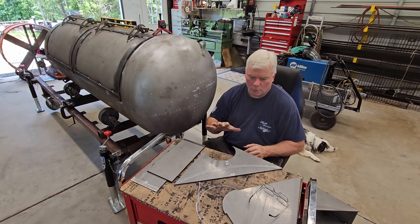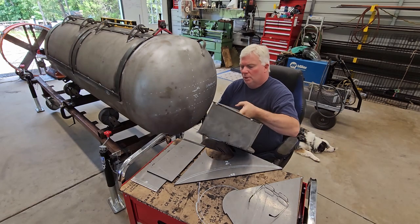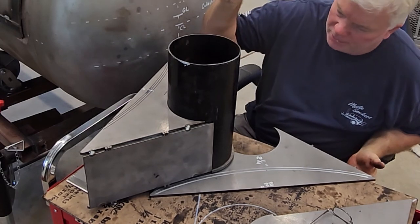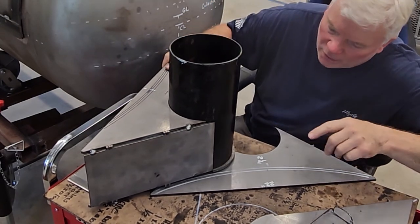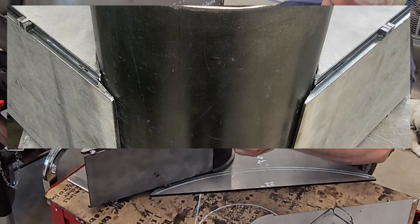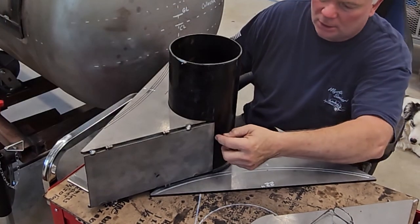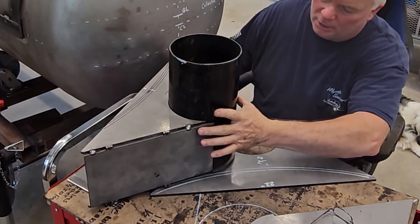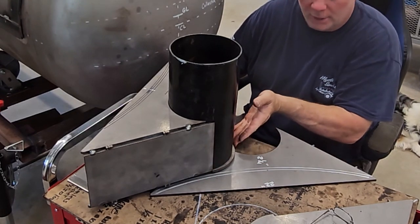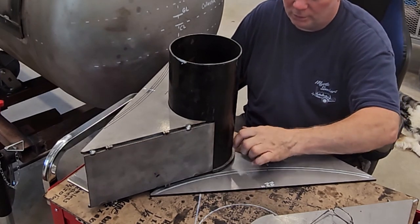Look at this and see how it's going to work. This is the first one I have attached. When we tack the collector up, it's going to look a lot like this. The Schedule 10 6-inch pipe slips right down in there perfectly. There are bevels on these walls that I do for you, allowing one-eighth of an inch of reveal on the walls so that you can weld a perfect outside corner weld — which is the easiest weld there is — to the pipe coming down and seal. I left plenty of meat out there for guys to weld on.